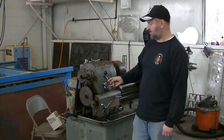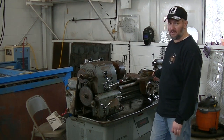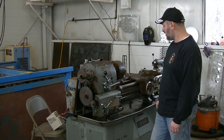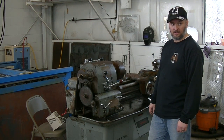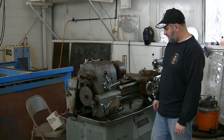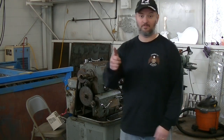I'm still going to do the oil service on the headstock, the gears, and the apron — which actually has an oil reservoir in it as well — so I've got to get that done. I'll order those parts and they'll be in within a day or two. Get the rest of this wiring buttoned up, the belts on, and we're in business.